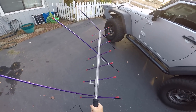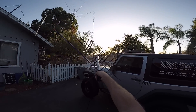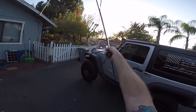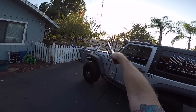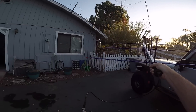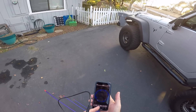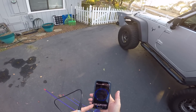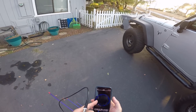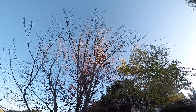This is not going to be a super high pass. It's going to come from the south, which is over there, and I'm going to aim the antenna in that direction. I can change it for horizontal or vertical polarization. I'm going to turn the squelch all the way off. Now 18 degrees, coming in just a thousand miles away. It's going to be way off to the side — toward the house — so it likes that polarization.